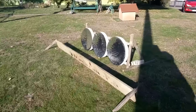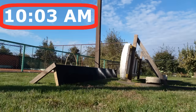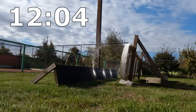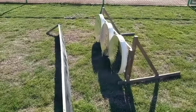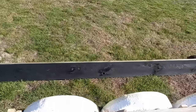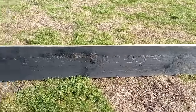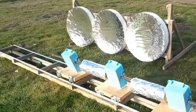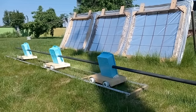Now I will show you an important experiment — this is the west-east line. It is morning, and these are the time points of one day, the 21st of October, and we see that these 3 spots move as a result of the movement of the sun across the sky from morning to evening. This is the same screen but the next day, and yesterday this mirror focused solar radiation into this spot, burning these traces every 30 minutes during 4 hours.